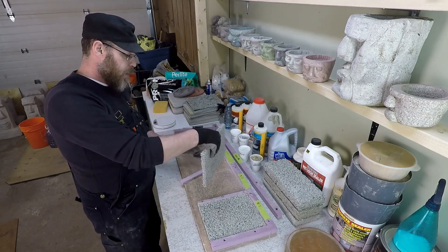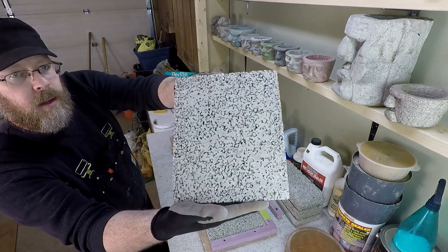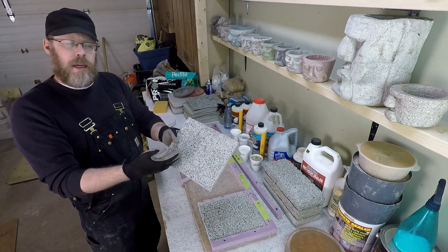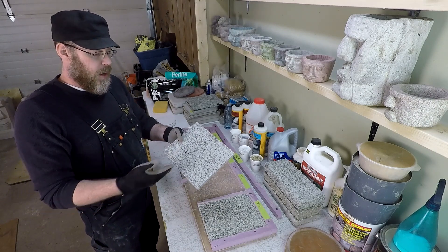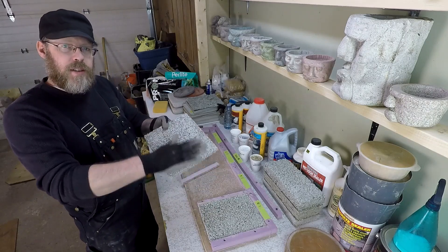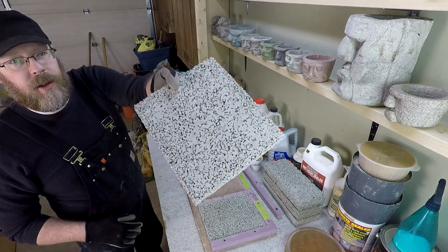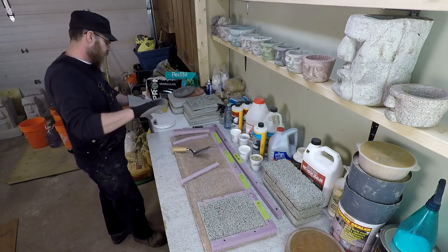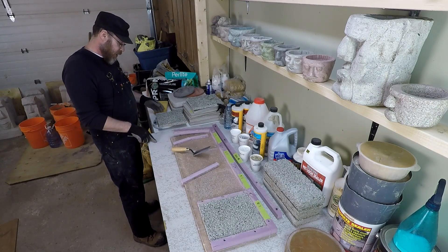The four-to-one is something I'm more familiar with — I've used it for a lot of different applications. Look at that honeycombing on the back — actually kind of cool looking. I've seen a neat technique where you flip the piece over, do a second application of a different color concrete like black or brightly colored, fill all those voids, then sand through the steps to make it super smooth. You get an interesting coloration contrast where the voids are filled with a different color. There's so many cool things you can do with concrete.